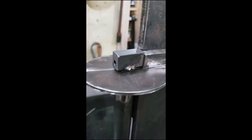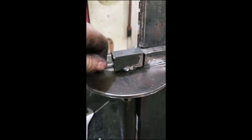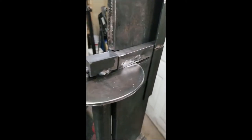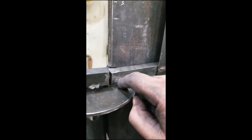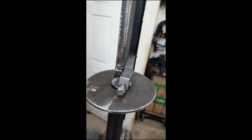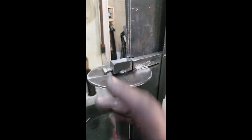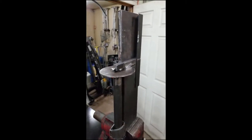So I had to make a contraption where I could take a bolt and put it in here — on that side I have a threaded hole — so now I can tie this all the way straight down. Then the last issue was that as I was pulling them, these pieces would stretch so much they'd pull out, so I ended up having to weld this piece here and this piece on the other side against the bracket, so that it wouldn't pull out or pull either way. Anyway, that's how it works — I'm going to set it up in the press and show you.